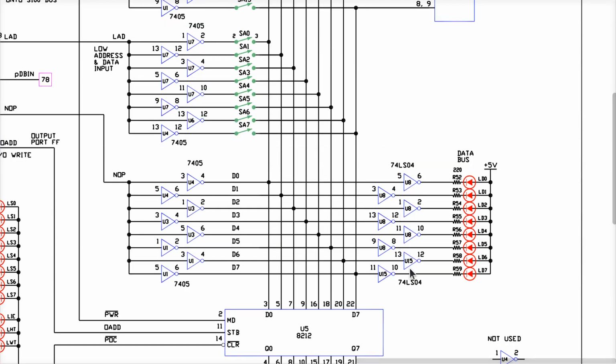I got LS04s and probably 05s lying around from the years gone by. I could easily pull out one of these chips and put a new one back in there. So, the next question is, do I just blindly start unsoldering these chips till it goes away? Should I clip the lead off the pin and then what? Maybe solder a little jumper wire on it if it's okay. Maybe I can get to the board traces. Maybe I should cut some board traces to sever these chips.